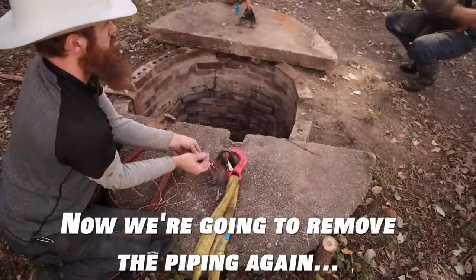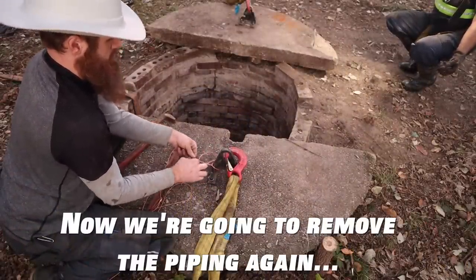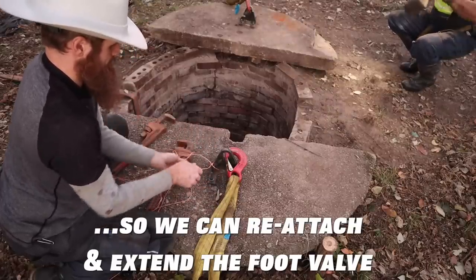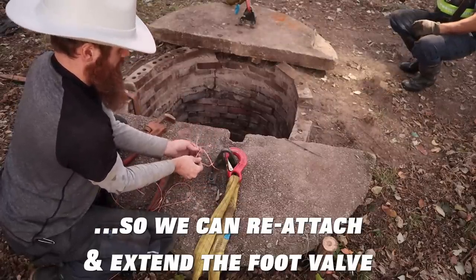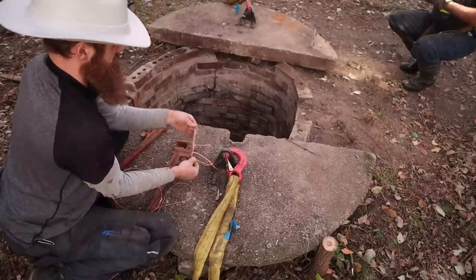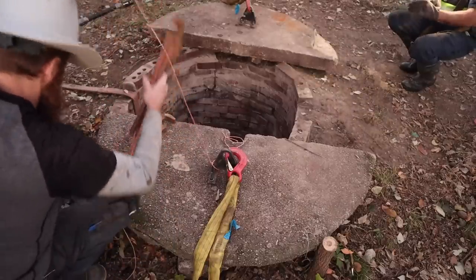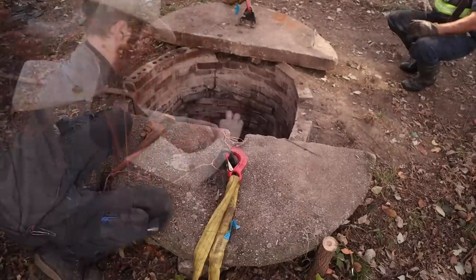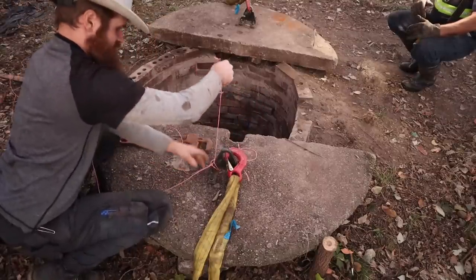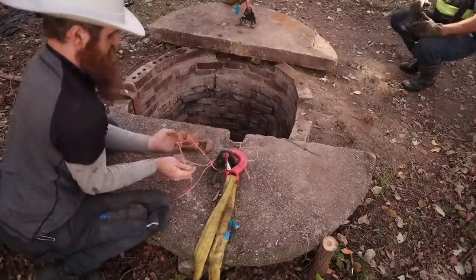Fine. To the bottom of the well, up to the middle of the ejector where that little quarter inch nut is, just to get a fine line. Okay. 45 puts me in the dirt. Okay. So we'll make it go 42. I'd say we can just measure off of that. Yeah, I think a couple inches would be safe. 42 off of that. 42 is a good number. Yep. I like 4 and 2. That's exactly what happened, though, didn't it? That pressure pushed it off. That's okay. It worked for when we needed. Yep. We knew it was a temporary fix anyway.